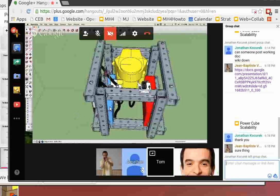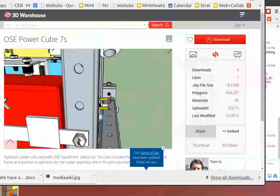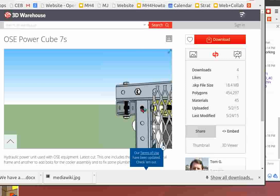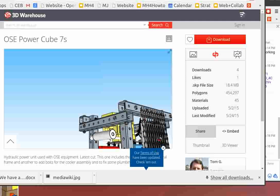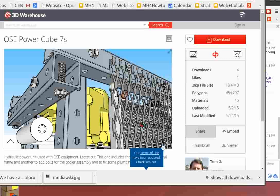Yeah, unless you're ramming into things. The use case where you back up a machine into a tree or into a building. That's why I mounted everything on the inside. What happens in a case like that? The mesh itself is pretty good for regular scrub, but if you go straight into a tree or a rock, the first thing that's going to go is what, the bolts or the mesh? If you back this up into something that's sticking out, all the critical components are beneath the frame. But if something pokes through and penetrates this oil cooler, then you can have oil run all over the place and lose all your pressure.